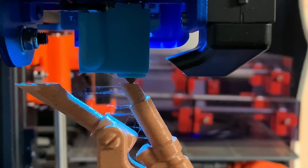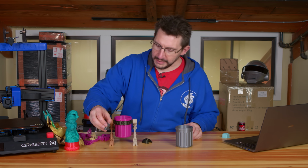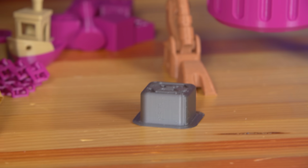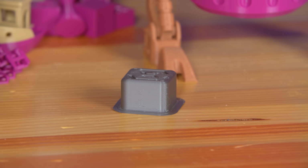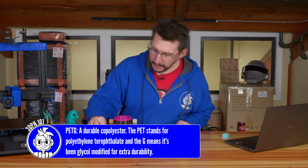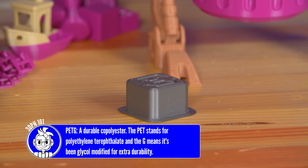This is all PLA though. People are gonna say, did you print something besides PLA? And I did. This is PETG, right? Not too bad. It's the same demo cube. What I did is once it started printing, I adjusted the temperature of the bed and the nozzle from the touch screen, and then it completed it. I think it did a pretty decent job knowing that all I did was adjust temperatures.